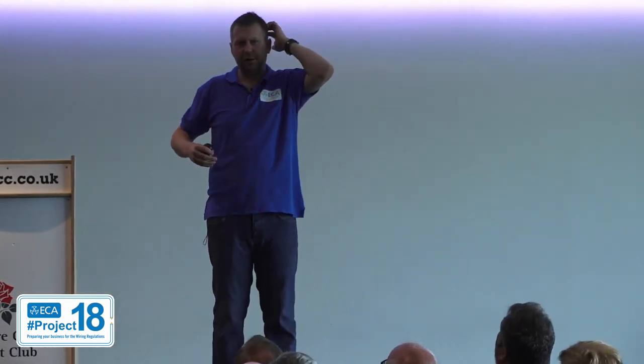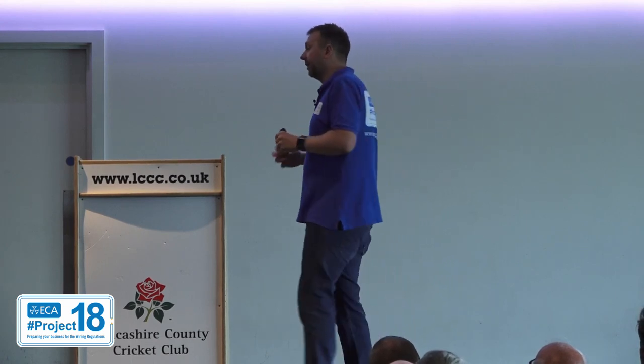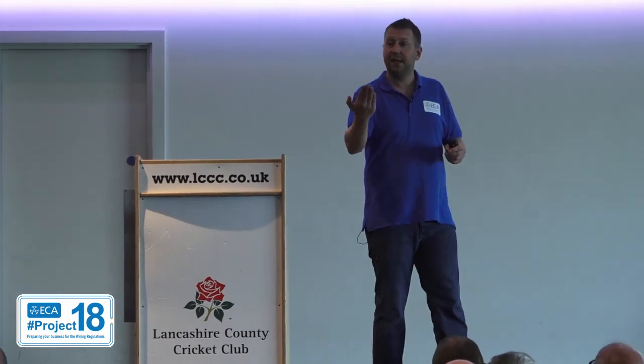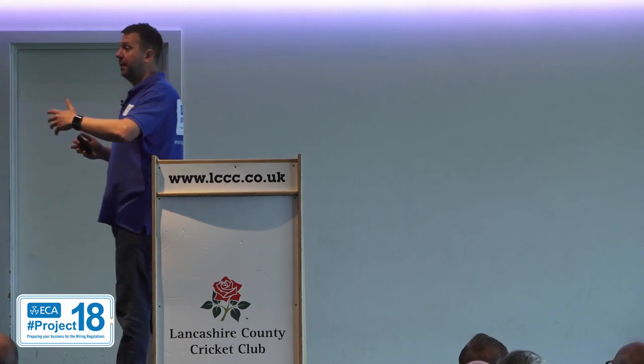Floor and ceiling heating — does anybody fit electric underfloor heating frequently? Did you know there's a special certificate for electric underfloor heating? It's been in there for probably 10 years in section 753. It's just information about the size, shape, where it's connected, and what type of heating system it is. It's not a model certificate like an EIC or EICR, just an information sheet — the wholesaler provides the data sheet and you fill it in. They've expanded it now to include outside heating and frost prevention. So if you're doing electric underfloor heating, make sure you've got the right form to fill out for your client.